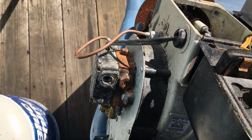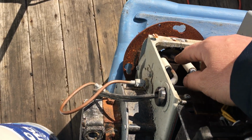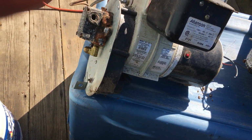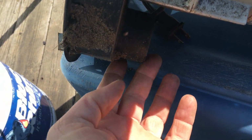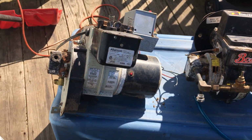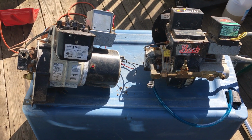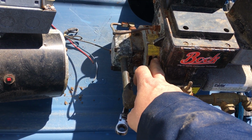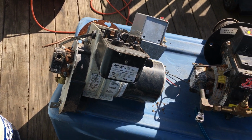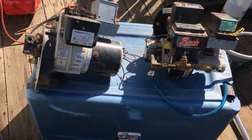Always leave that stuff for a professional, because they're going to adjust your electrodes, because those right there are adjustable. The air intake is adjustable, and as you can see, this one right here has a tube? A tube goes on the bottom of this one. Okay, they come in different configurations, and only let a service technician mess with them. Here is why. If you alter your air intakes and try adjusting things on your own without having the meters for carbon monoxide, you could actually kill yourself slowly doing this.